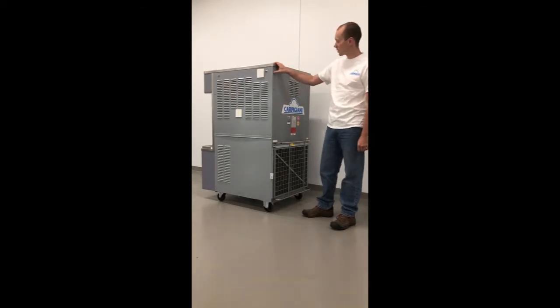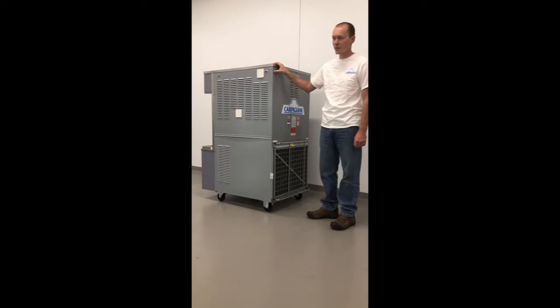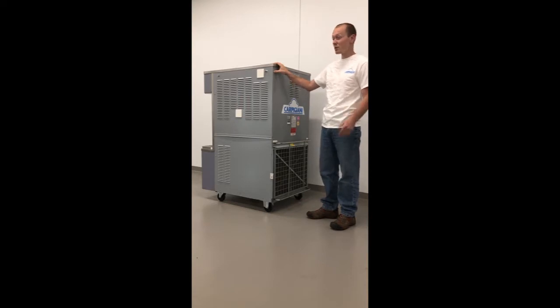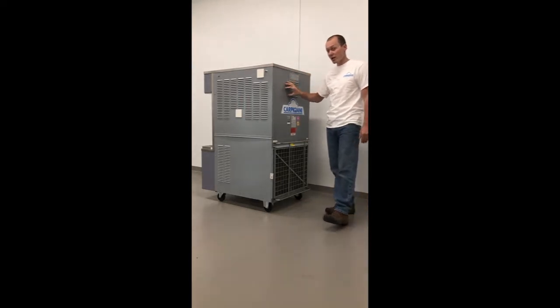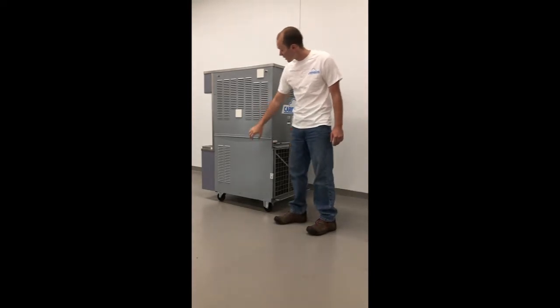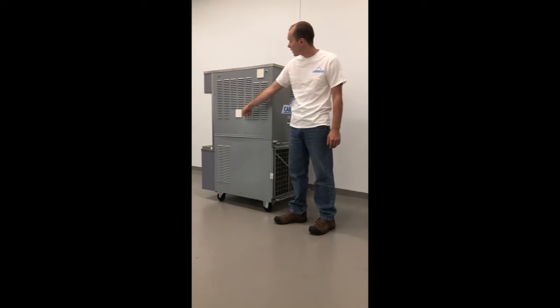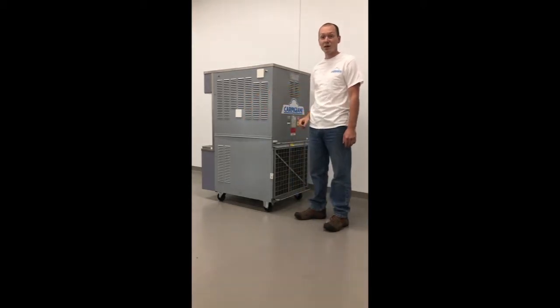Alright, today we're going to show you how to change a pulley on the ice cream side of a K3. If you've had complaints of a belt slipping or a squealing noise, that's why you would need to do this. You're going to have to remove this back panel, these two side panels, your cone studs, these two blank offs. We will take care of this and we will be right back.